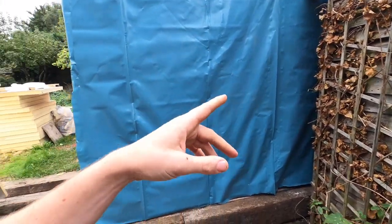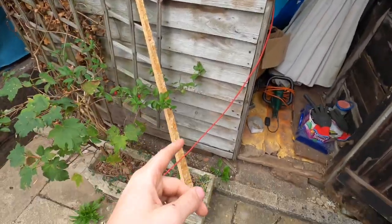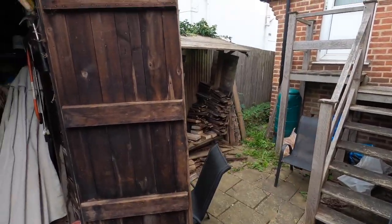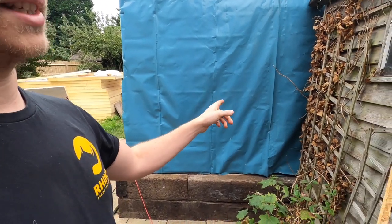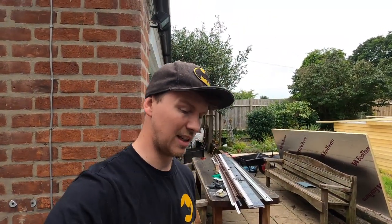So we've got here — this is the outside, which is going to be clad the same as the front. The armoured cable is fed all the way underneath and comes up in this shed. It's actually been terminated-ish. By the looks of it, it's a 4mm 3-core, so that's being tested, this is being ripped down. There's going to be a waterproof joint here, extended across into the back of a fuse board. That runs through into the garage. There's an old voltage-type RCD. I'm not putting an RCD on the feed cable because you don't have to on supply cables. It's going to have its own little 2-gang garage board with RCD protection, so you don't get nuisance tripping and diversity between two RCDs.